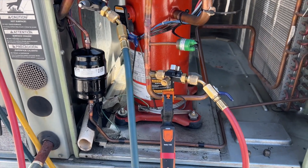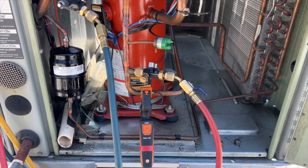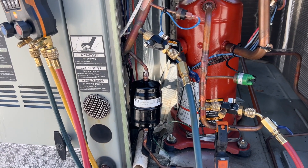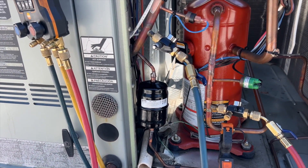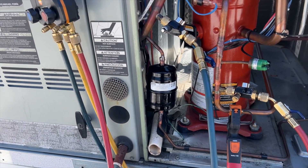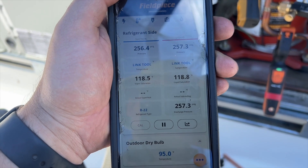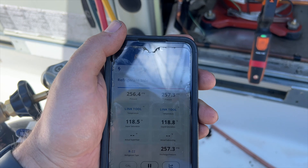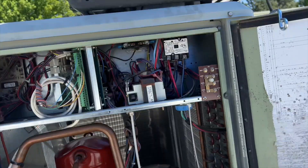I'm going to just put the probes on here and test the pressure that way — I just don't trust these hoses. Annoying because now I have to go down the ladder to the truck, back up the ladder, and do this again. We're back — she held pressure. It's been a little over an hour — hour 12 minutes. Not bad. We're pulling a vacuum.